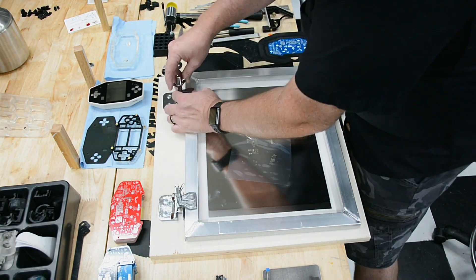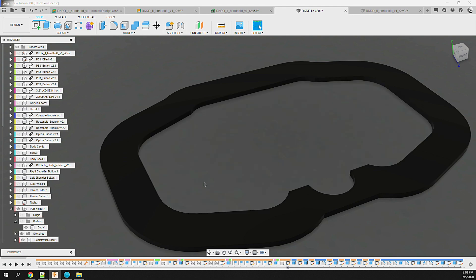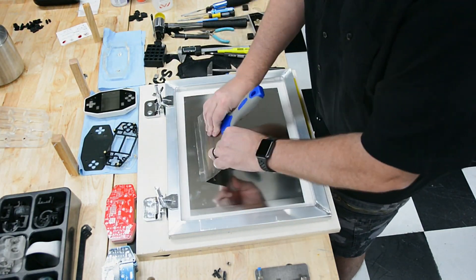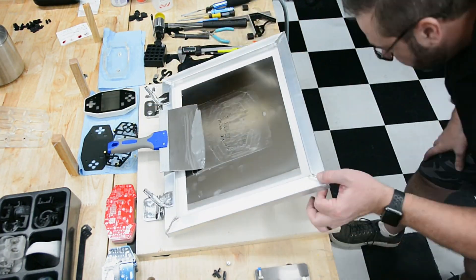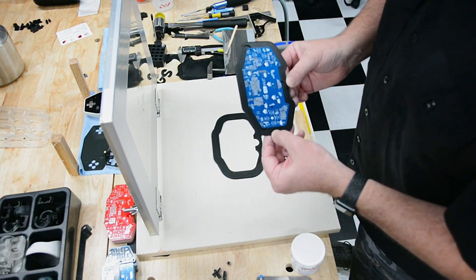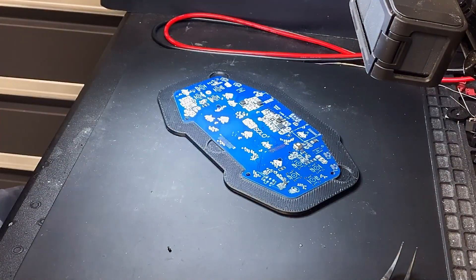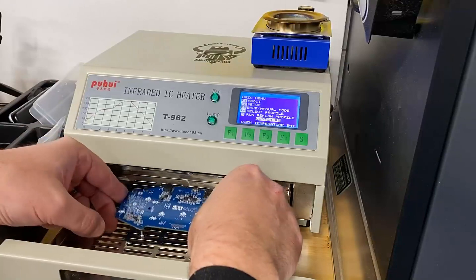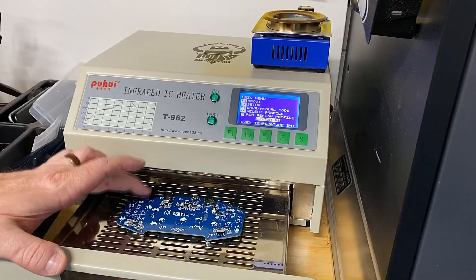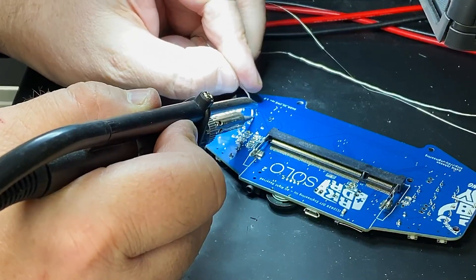Next was time to assemble. This time around I built a more legitimate screen printer setup using some butterfly hinges and the frame stencil from JLCPCB. I 3D printed a board holder and frame, attached the frame to the printing station, then loaded the board. Pulling a thin even coat of solder paste prepared the board for assembly. The board holder pops out and makes part placement a lot easier. Using my surplus of Arcader bill of materials items, the first two prototypes were hand assembled at my electronics workbench using my AmScope. Most components are 0805 size, so it's pretty easy to assemble by hand. Once assembled, I ran a custom heat profile on my modified T962 reflow oven. After baking, I manually installed all through-hole components and soldered them by hand.